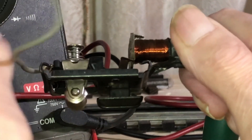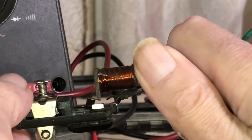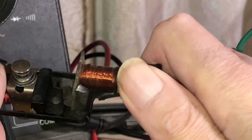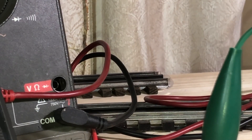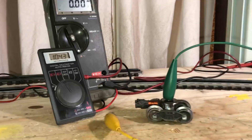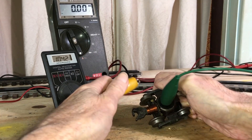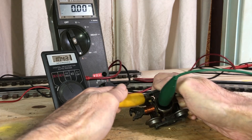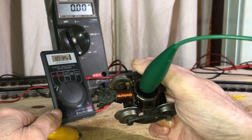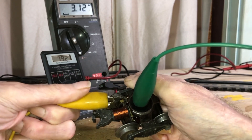The center roller here has no purpose in this discussion — this was for a whistling tender, so it has nothing to do with the uncoupler. That's how it's supposed to function. We've got 10 volts AC on our meter, and if you just take your center rail pickup or jumper cable and touch that tab, it'll open up. It shouldn't take any more than that to get it to open up.